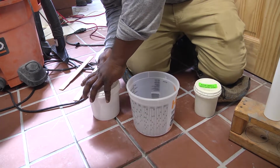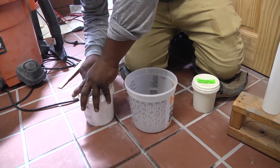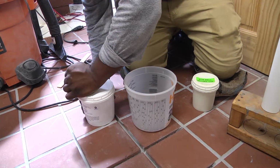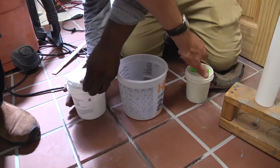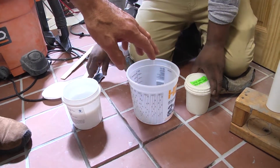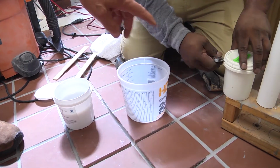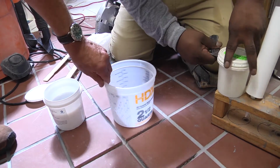Next step is to open the kit for the Marcoat ES pour grout. It's a 2-to-1 mixture. We've got resin on one side, 600 milliliters, and we've got hardener on the other side that's colored. Doesn't say it on there, but it comes in a color. The hardener and resin get mixed together, 900 mils total.